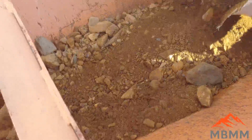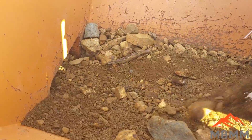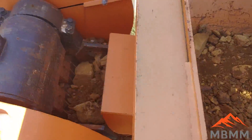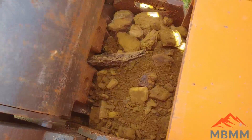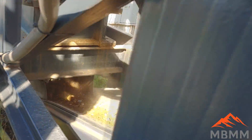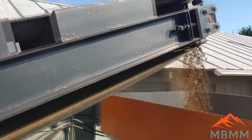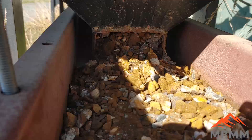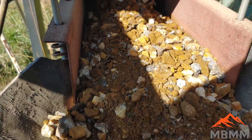The whole process starts here with our primary jaw crusher, and the ore is fed into this vibrating hopper, which vibrates the ore down into the crusher, where it's crushed down to about 10 to 15 millimeters in size. It's discharged onto the conveyor that brings the crushed material up into this holding bin, where the material can be evenly fed out the bottom of the bin using this magnetic feeder.